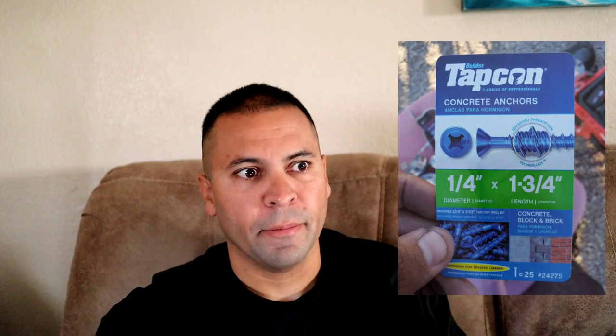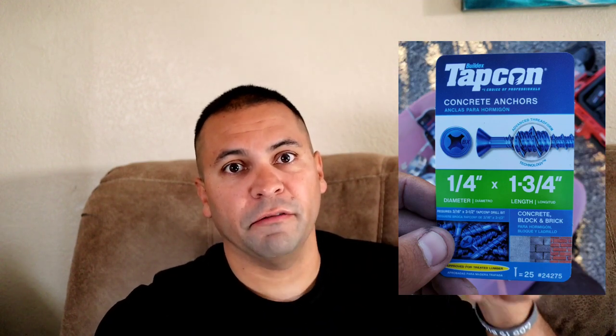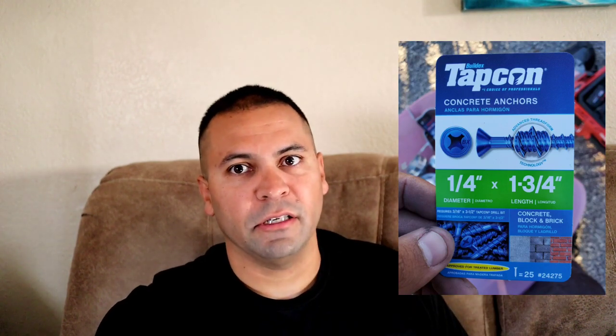We only had one real hiccup — the Lowe's rep gave me the wrong bit size. Funny enough, my wife went to a hardware center and the gentleman there argued with her that you need that same wrong size bit. I had to get on the phone and say no, I need a one-fourth inch bit for a five-sixteenth inch masonry screw. He kind of argued with me too, so it seems like a common misconception. Be very cautious: these screws require a size down — five-sixteenth screw needs a one-fourth bit, one-fourth screw needs a three-sixteenth inch bit, and so on. Where the Lowe's reps were absolutely right was that it was the fastest way to do it — without the bit delay we would have been done in an hour or less.